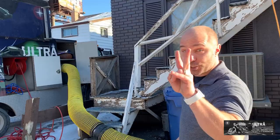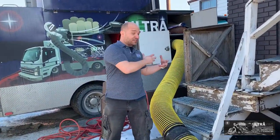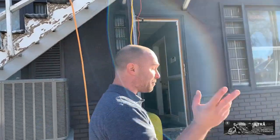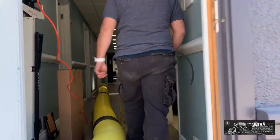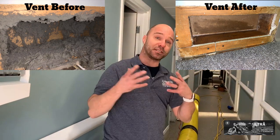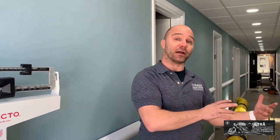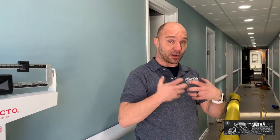As you can see, we have two lines. A vacuum line, which sucks everything out, and our air pressure line, which allows us to run our pneumatic scrubbing system through the ducting and venting. What we've done in the cleaning process is remove every single vent and run our pneumatic system back and through it while the vacuum system is hooked up. There are two elements to a breathing system: the blowing or supply side, and the return air. You want to make sure you're working in tandem with those two sides because your vacuum system has to extract what you're scrubbing.